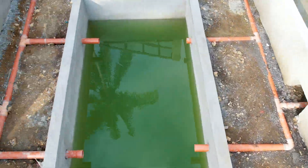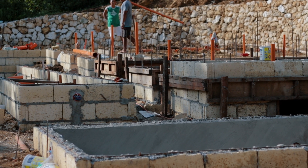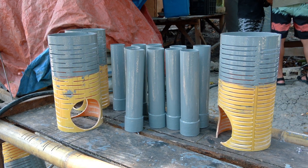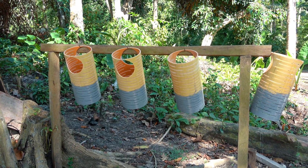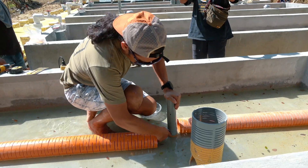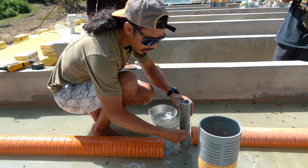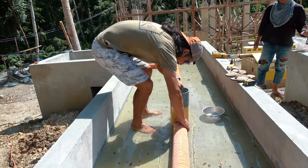Aaron, our aquaponics specialist, gave us a great tip. He says that some of the plumbing may get brittle over time because of sunlight and deterioration, so he suggested that we paint any plumbing exposed to sunlight. On our drains we bought some gray paint to match the rocks and concrete, and we started painting exposed areas. This is a tip for you guys — if you have anything exposed that can't last in the sun, make sure you properly cover it to protect your investment.